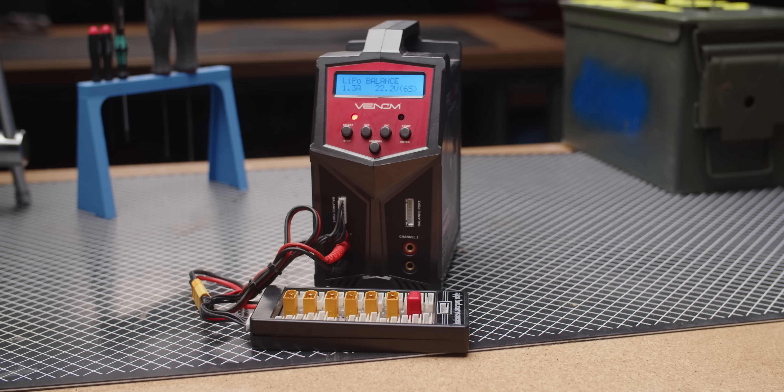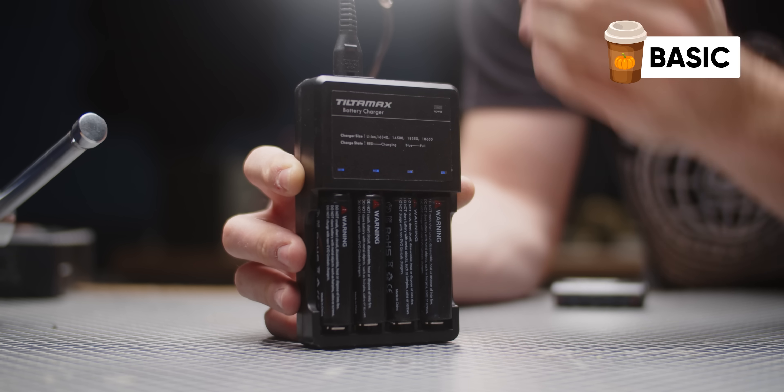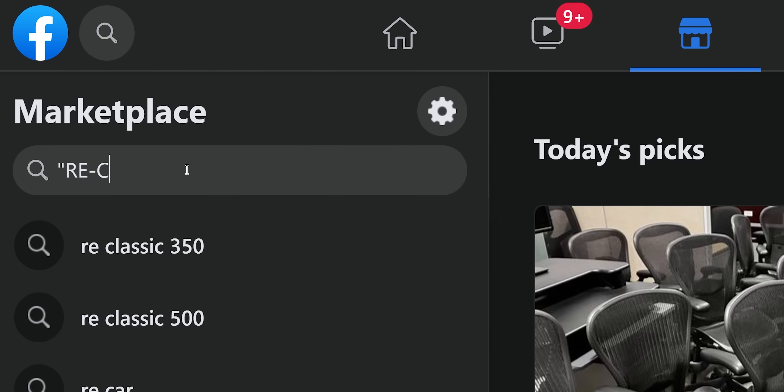The next tier is soft obstruction, which almost always exists solely to prevent end users and third parties from repairing or rejuvenating their devices, with manufacturers often citing safety as justification. There are four different types of BMS: dumb, basic, smart, and evil. Dumb means no BMS at all, like RC LiPo batteries. A basic BMS allows safe use and charging while protecting against under- and over-current. A smart BMS includes cell balancing, capacity learning, and self-resetting faults. Finally, evil BMSs — thankfully rare these days — switch off permanently after a set number of charge cycles even if they could still work.